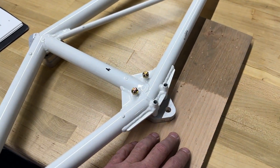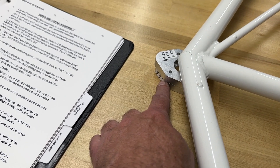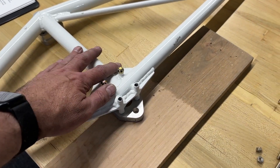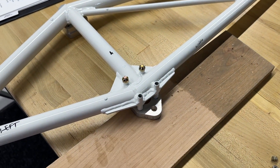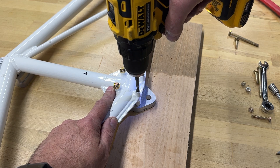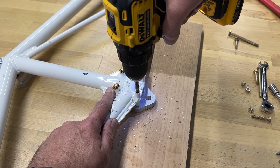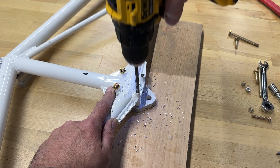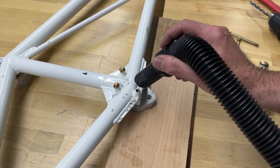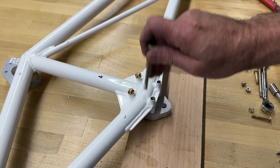Here's my setup: I've got my spoil board that I'm going to drill into when I drill through these tubes into the piece. I've got extra little parts shimmed up so the piece is sitting pretty parallel to my work surface and it's steady. I'm just going to hand-drill at this point because the tube is going to kind of be my drill guide. That's a nice fit - let me do this one now.